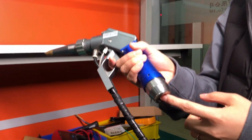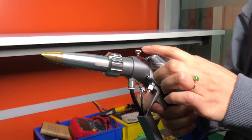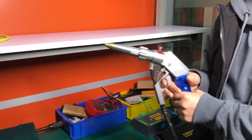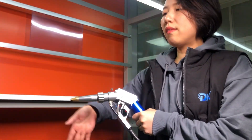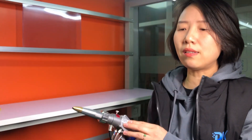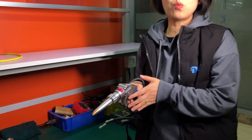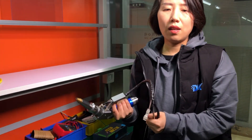The laser came in here, and then there is a collimating lens here, and a focus lens here, and the protective windows here. So it's more like the desktop laser welding head. The laser beam came out here and can only do linear movement. The advantage is very stable because there is no movement of the optics. But the disadvantage is that the welding gap is very small — when the joint gap is wider, you cannot use laser welding. And this defect has limited the laser welding technology for many years.